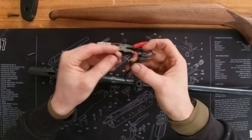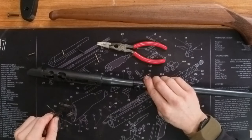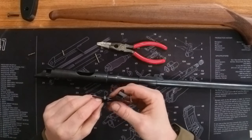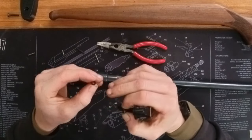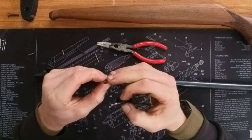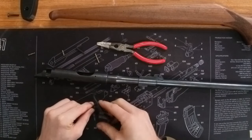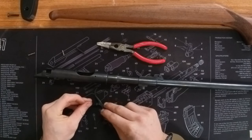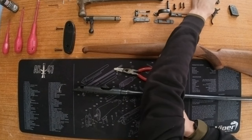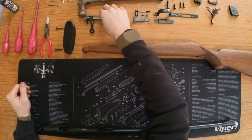There's a little spring at the front and the ball bearing sits on the spring at the back. There are actually a couple of pieces to it — the spring itself and a little flat plate. The flat side of this faces upward towards the maker's mark side, and there is a tiny little washer which has a cut-out for the flat pin. Just be mindful of that when putting it back — it can only really go one way. The top is the concave side, which helps locate the spring. There is another pin on the back — the longer one is for the trigger and the shorter one is for the sear.